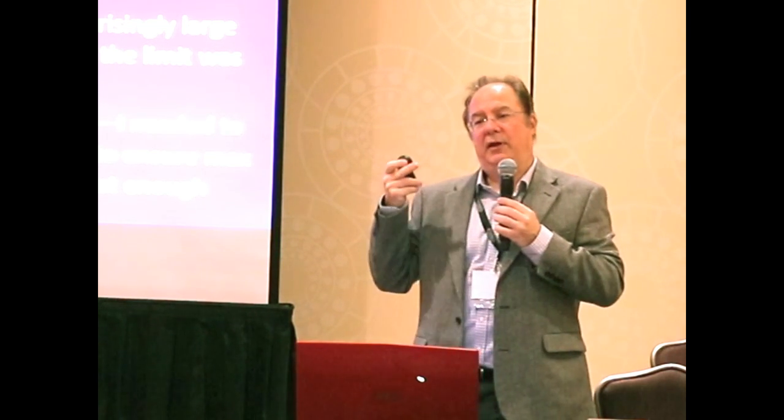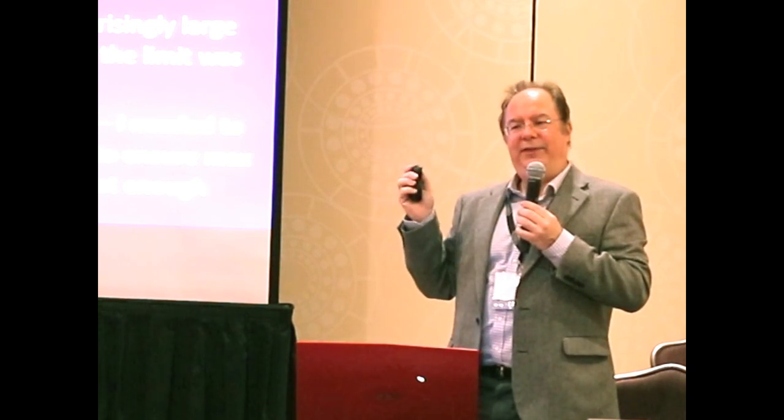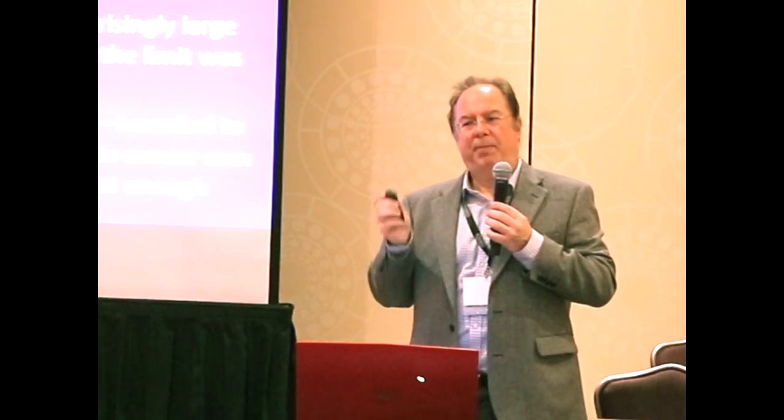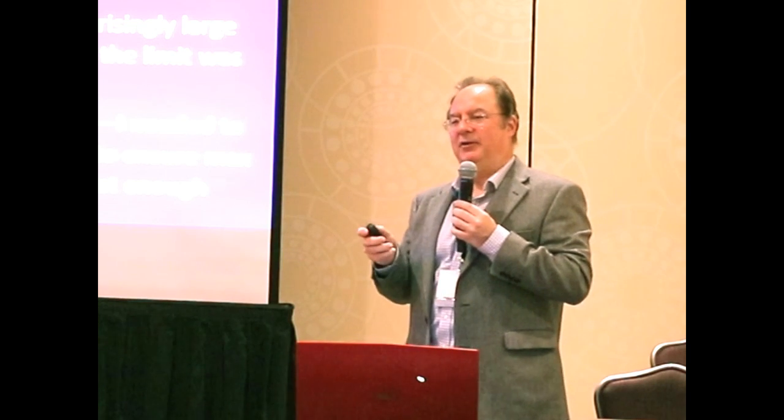I also realized that if we didn't have a sinc function filter, we would have timing errors because of the 22 microseconds, and we need much better performance than 22 microseconds. And that these would be important subjectively. So I felt that was the reason why digital sounded so bad. I was wrong. It was bad because of other reasons, as well as this, which is why I ended up designing my own DACs, because I could solve the other reasons. But nonetheless, this problem of transient timing recovery is a major, major issue.